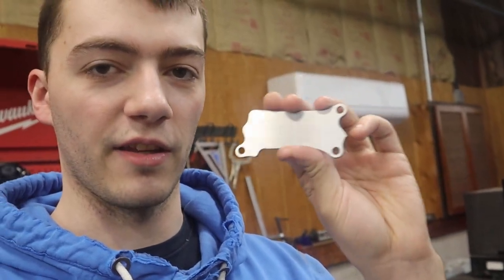I'll probably do a video on actually surface grinding once I get a little more practice in. The cool thing is, now that I have this to get to the actual size I need at 125 thou, I don't have to hard mill the actual blade out of the block — I can just hard mill the bevels, which will save me a ton of time on the machine. That also leads me to think I should rethink how I'm fixturing these — instead of doing this three-bolt system, maybe do a clamp and one bolt and a dowel pin. I have two blanks, so I'll use the current fixture style and see what I can get, then think about remaking the fixture after that.